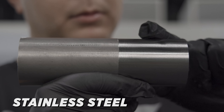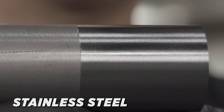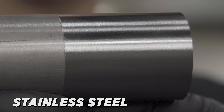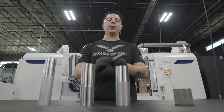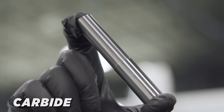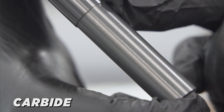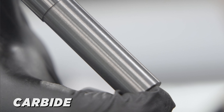Let's take a look at the stainless. You might recognize the bar stock from the dual diamond process form grind that we did recently. As you can see from the regular bar stock, we got a good grind on it — minimum chatter and a good finish for what a roughing wheel is capable of doing. Now let's look at the carbide. We stole this from Barry's tool grinder, but I wanted to show you the versatility of the wheel. It really shows the capabilities of what a grinder is used for. This type of process would be used for making ejector pins for mold cavities, and you can really hog off a lot of material and make a lot of parts using minimum waste of your wheel.